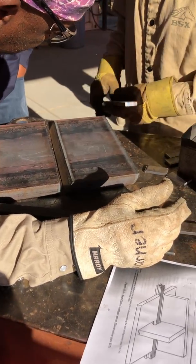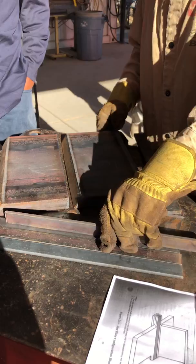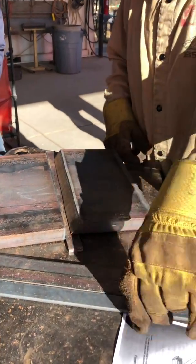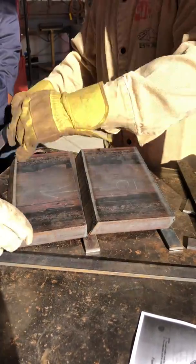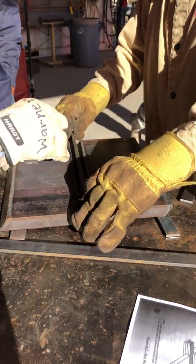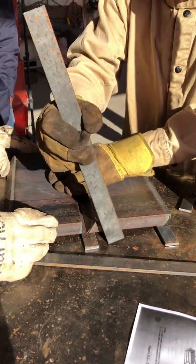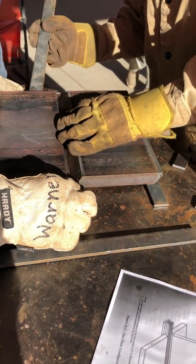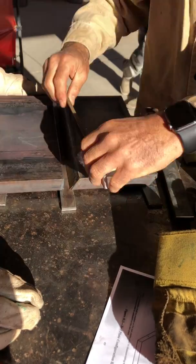So that's what it's going to look like to weld inside. You're going to have an extension — an inch and a half on each side. What I recommend you do is use these to level them off. Then you get to a 3/8 inch space. Make sure you're square. You can adjust it a little bit.